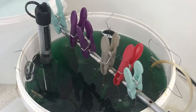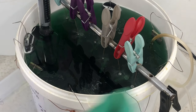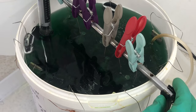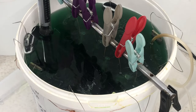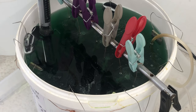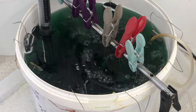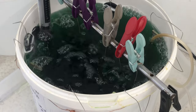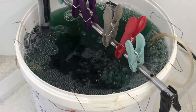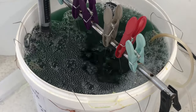I'll show you that a bit closer — hopefully you can see them fizzing away pretty well. I'm happy with all the connections, making sure they're all fizzing together. Now we can set the agitator — it's simply a fish tank pump that agitates the material to make sure the plating is getting pretty even. We'll leave that now for 30 minutes and come back to it.